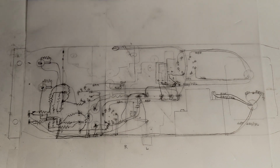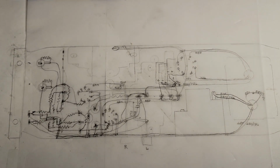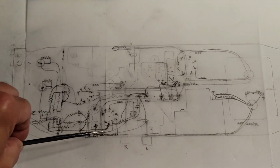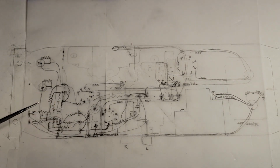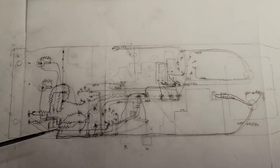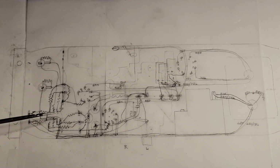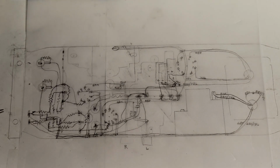That's an important difference between typical point-to-point wiring in a tube amp and a circuit board in a modern solid-state amp, or a circuit board in any amp: the circuit board is two-dimensional. In the point-to-point wiring tube amp, we have that third dimension to utilize. So where you see all these wires crossing each other over here, that's utilizing that third dimension. What it allows us to do is optimize the angles of those crossings. In particular, the best practice is to have different wires crossing at right angles so that the induced field is nearly invisible to the other wire.